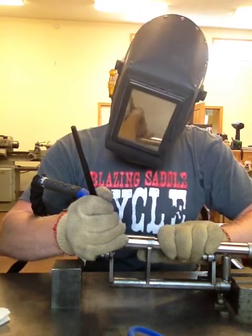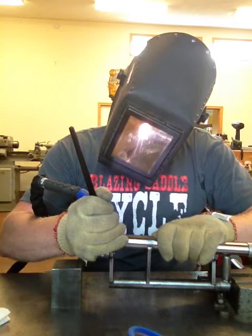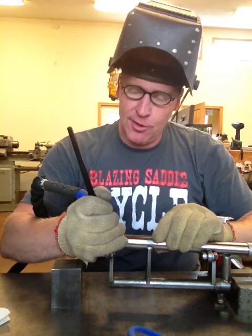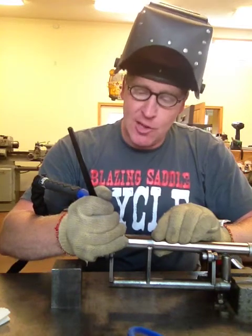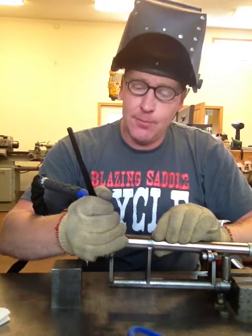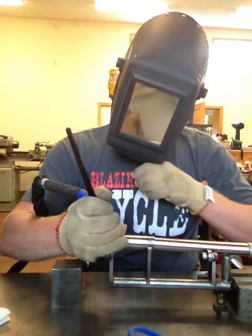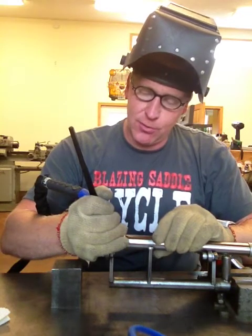This last one I'm just going to go ahead and continue my weld, slowly rotating my grip as I go. I'm able to do a little longer runs inside the purge fixture because the entire inside of it is purged with argon. So it lets me get the piece a little hotter than what I normally would while still keeping it fully encased in the shielding gas.